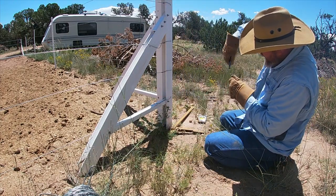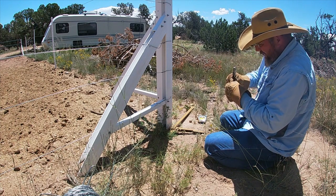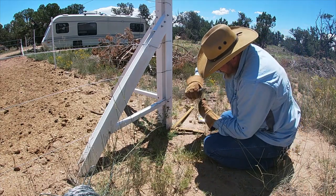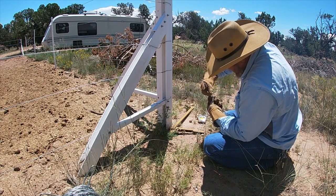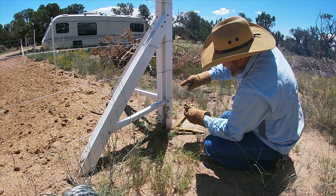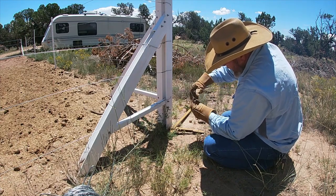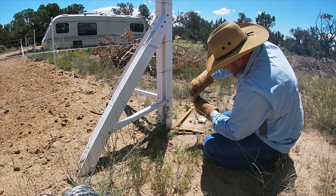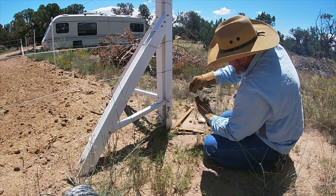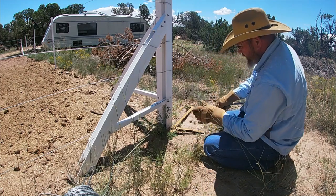So what I do when I'm doing barbed wire to timbers, and I'm just tying off, generally I will take off about 3 or 4 barbs. My hands actually have to get shocked, don't want to play. This particular wire has the barbs all on one strand, so that's pretty nice. Some of the cheaper brand wires, like the high tensile wire, has the barbs over both of them, and you kind of got to untwist them off of everything. So I'm gonna do 1, 2, 3, 4, 5, depending on the length here,